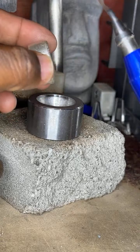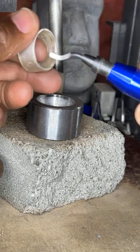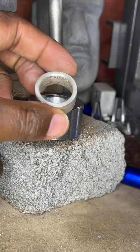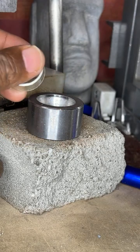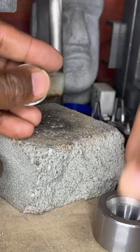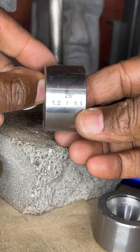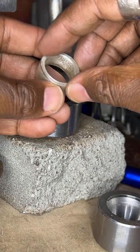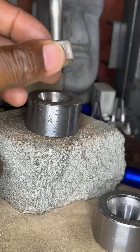Then I'm going to take this process to clean out the inside layer and the outside layer, which is the cut edge. Then I will continue the ring by shaping it in a dome fashion, which I won't use a straight wall to do. I'll use another reduction die, a 25-degree die, and this will cause the coin ring to curl here and curl there and give it a nice flat tire look. Okay.